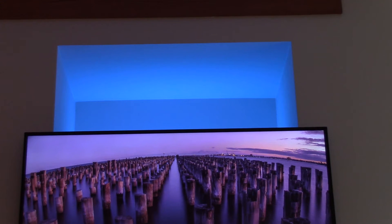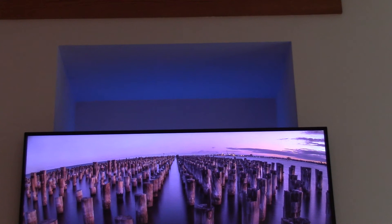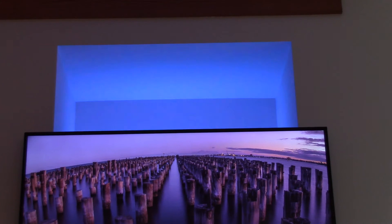It makes a nice nightlight. And of course you can change the intensity. You do see some flickering there — I think that's a result of the 60 hertz flickering on the bulb beating with the refresh rate of the camera. So that actually does not blink in real life. So that's kind of it.